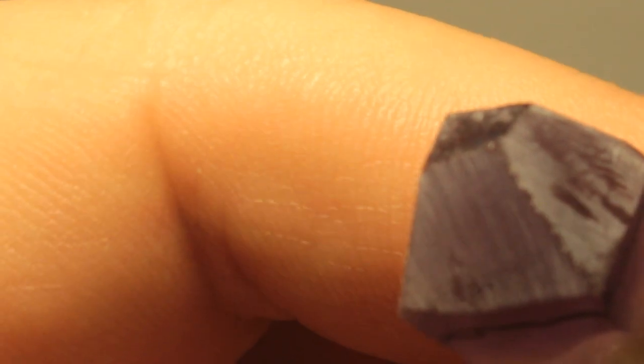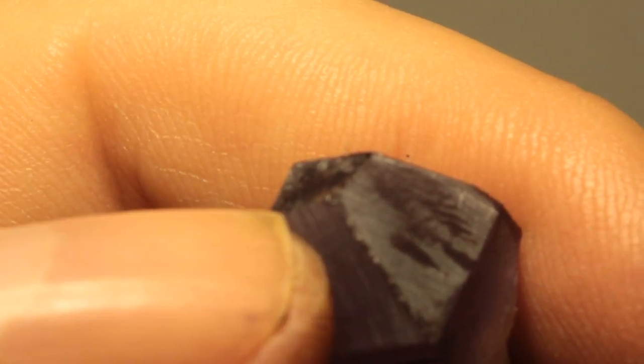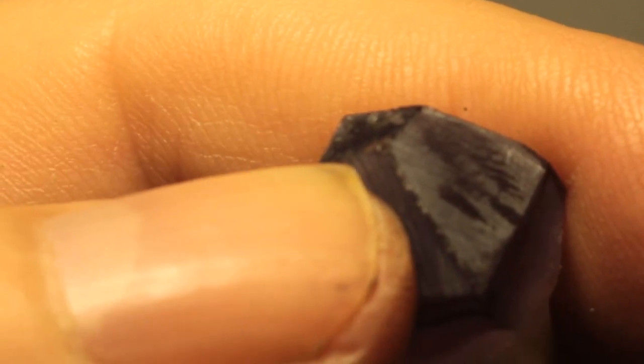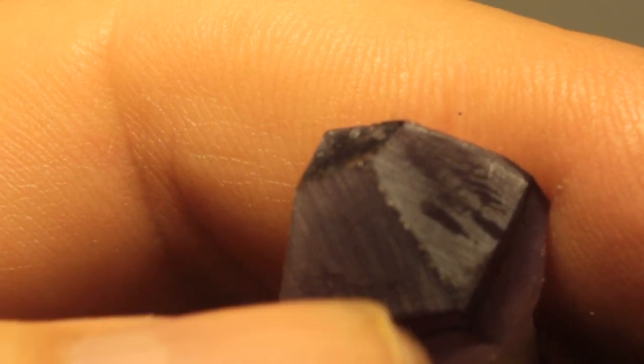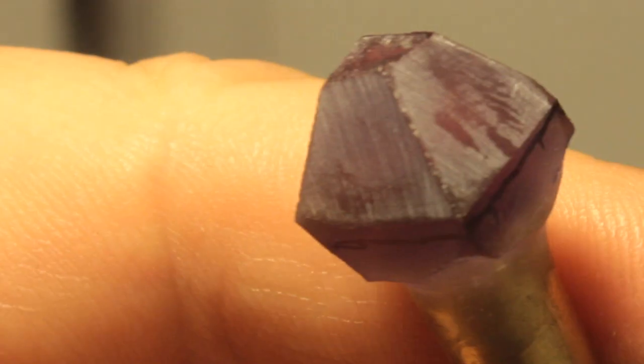Instead of following the order of those instructions, what I'm going to do is reverse them. I'm not going to do the 53 degree angle yet, which would be a different angle going down somewhere to here, maybe a little lower, maybe a little higher. I'm going to skip that for now and go to the final instruction for establishing the point, at a 43 degree angle, making a permanent center point. Then I'll go back to the 53 degrees and cut the difference between whatever's left, so there will be three different facets. It seems to make more sense to me, so we'll see how that works out.